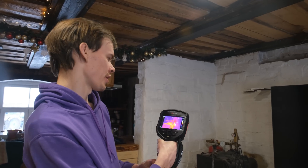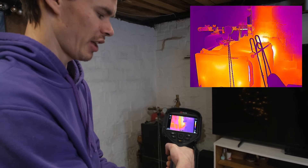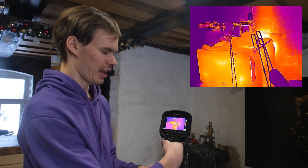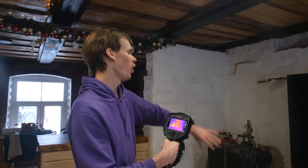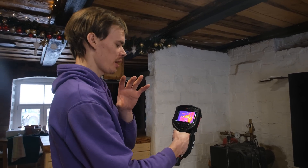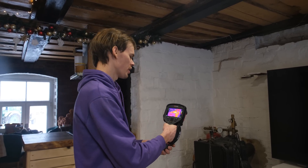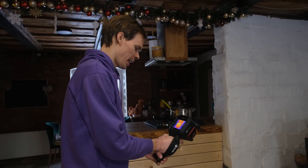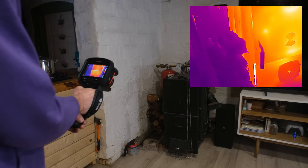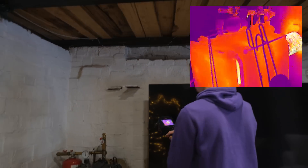The first thing I want to show you is the stove. As you can see we have a central heating boiler, so the actual stove itself is on the outside — no more than 80 degrees. A lot of you are worried that we have wood stacked against it, but it is all covered in water — the heating chamber is covered in water — so the actual exterior of the stove is the same as a radiator in your home. In the front we only have a maximum of about 50 to 60 degrees on the hottest spot.